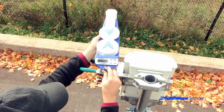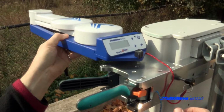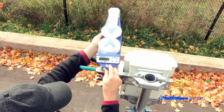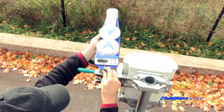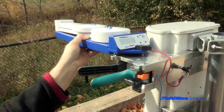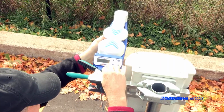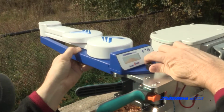Once you have decided how to position the tool in the bracket, line up the mounting screw over the center mounting hole of the bracket plate. Make sure that one hand is supporting the free end of the tool. Then gently allow the two tapered pins under the mounting flange of the tool to drop into the tapered holes in the bracket plate. Then tighten the screw until secure.